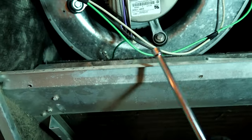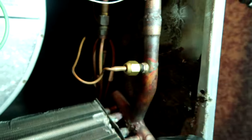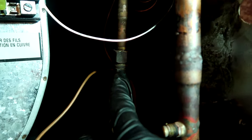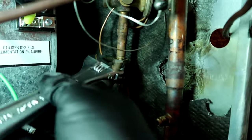The new coil comes with a new one on it, so I just put the new one in. Now we've got to get this tray up out of here. We'll unbolt the equalizing tube, and do the same with the TXV - get some channel locks, hold that, then with the crescent wrench it'll unbolt right off. Then I'll sweat it out from up here - you can't get your pipe cutters in here anyway.